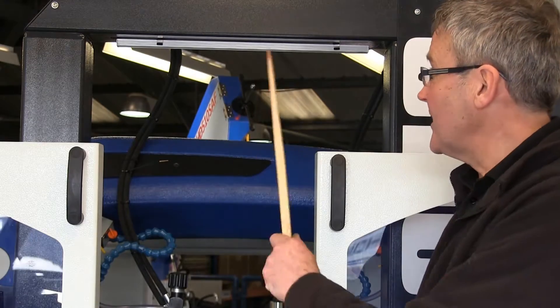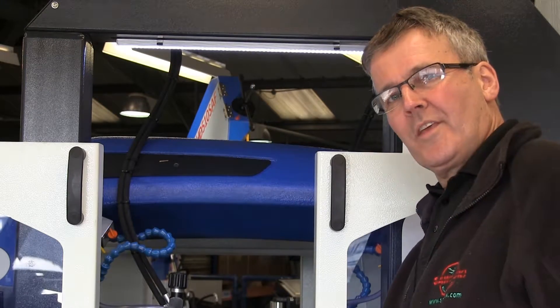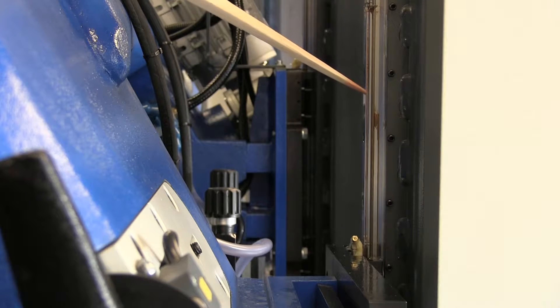As you can see there's an LED work light here and a flushing hose to remove all the swarf at the end of the cycle of cuts. The machine has a three kilowatt motor and goes up and down on linear guides, which are standard on CNC machine tools today.